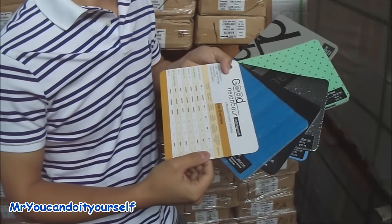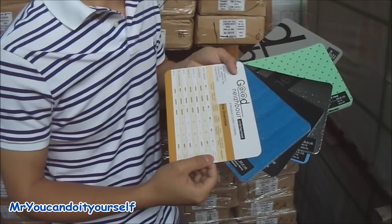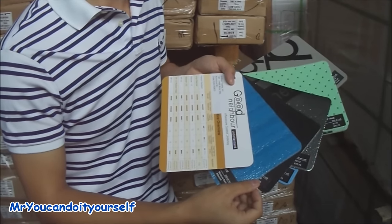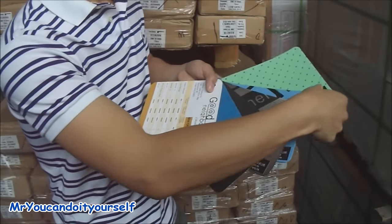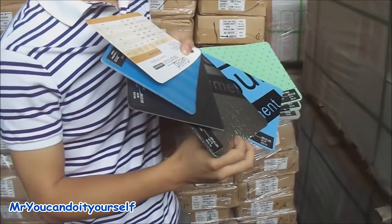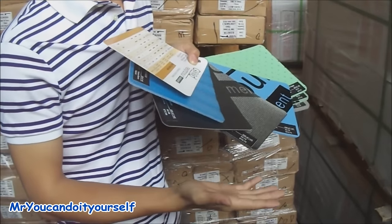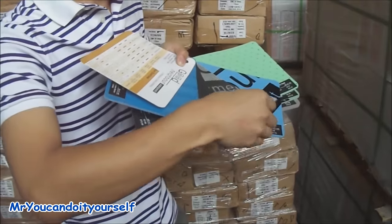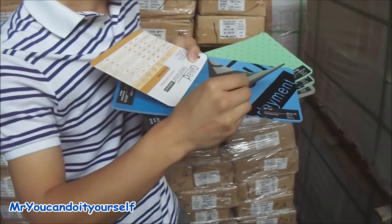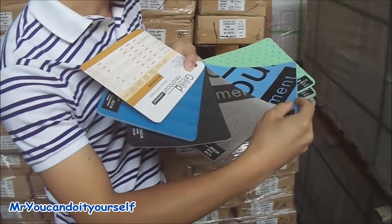Can you tell me what kind of underlayment I can use for a basement if the moisture is a little higher than normal? So many people ask me if we can use laminate in a basement and how we can protect from moisture. For the backing, we lay it on the floor and that will block moisture from the bottom — from the plywood or the concrete. There is a silver backing and also a plastic backing on top of the foam.